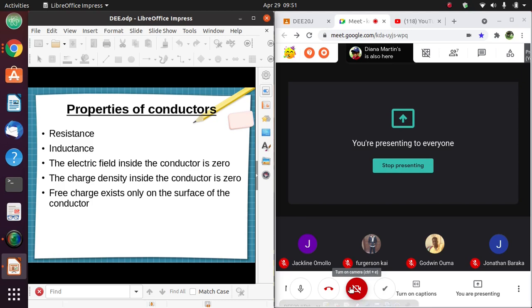So you'll find that if I don't take into consideration that value of inductance, then the current, or the voltage that is coming to us, will drop. And it should not drop significantly. Because we distribute our power through AC, we have to take that value of inductance. When you have too much inductance in our electric conductors, then that voltage will drop significantly. Are we together?